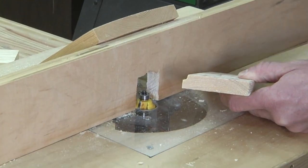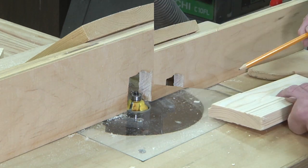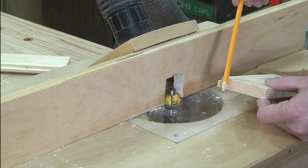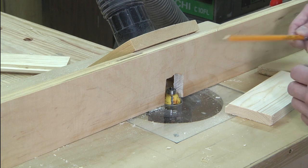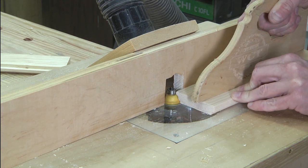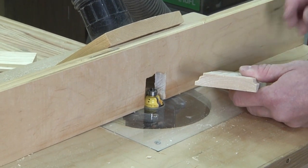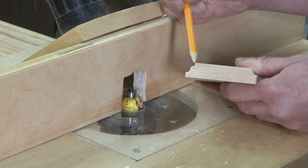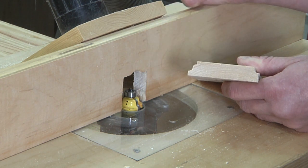You can see we just have that slight S-shape going. Now I'm going to set it deeper — what that actually means is it's going to go deeper into the wood, which actually requires me to raise the bit up out higher on the router table. And just like before, we now have this little step, which helps catch light and shadow, making this a more dramatic little decorative trim piece.